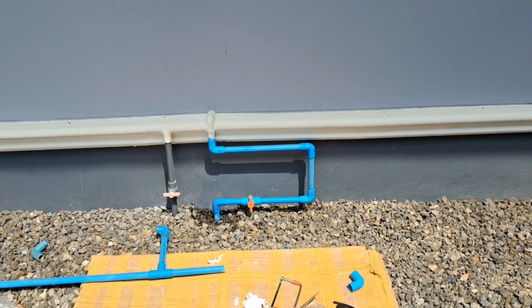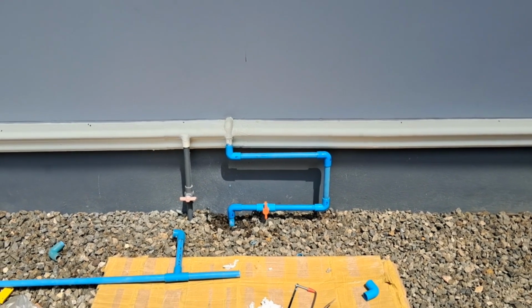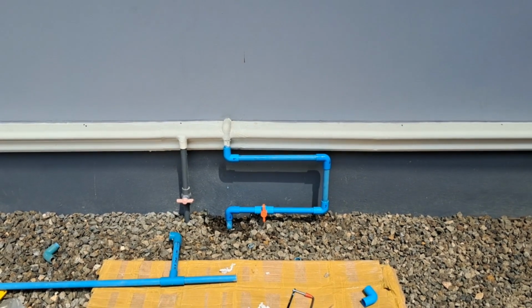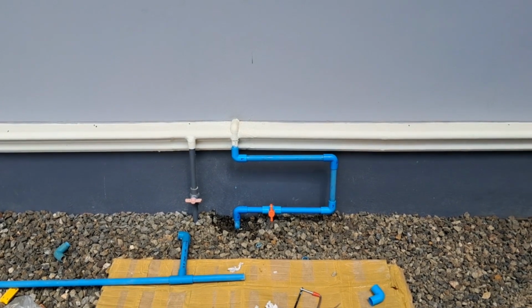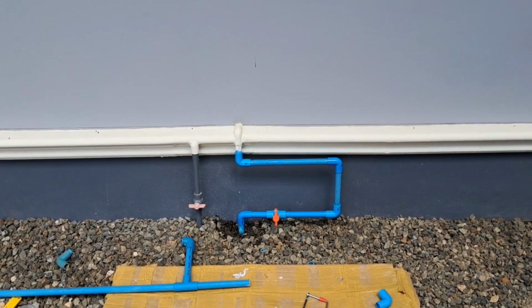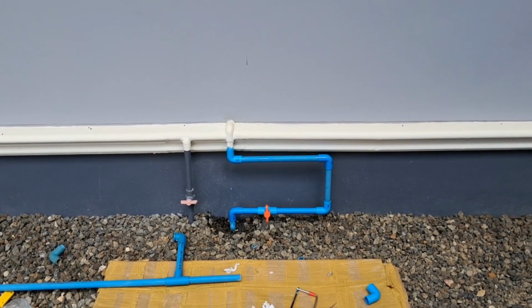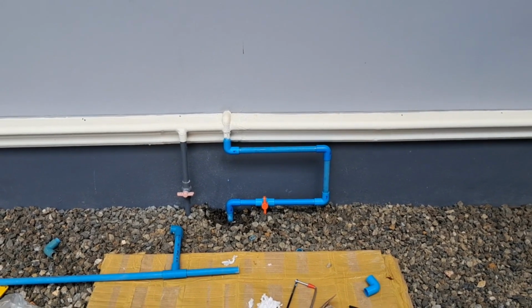Get the water back on, and then I know at least that valve's cured, and I can then see if the pump continues to cycle. And if it does, then I really have got a problem, because so far I've got not a clue what might be leaking, and it's almost bound to be a joint in preference to an actual split in a pipe.